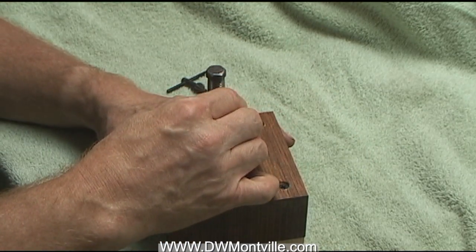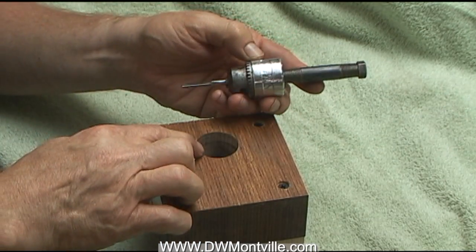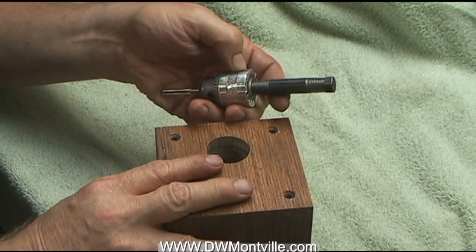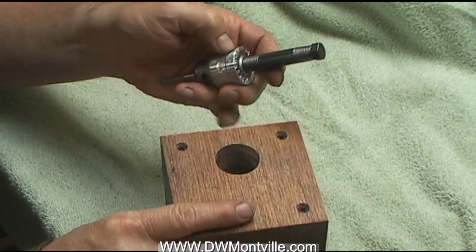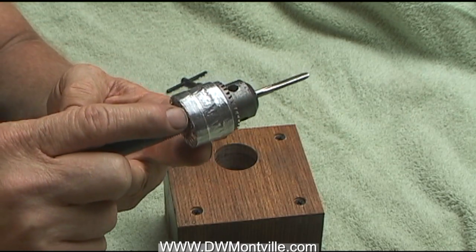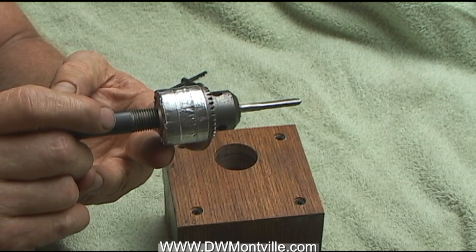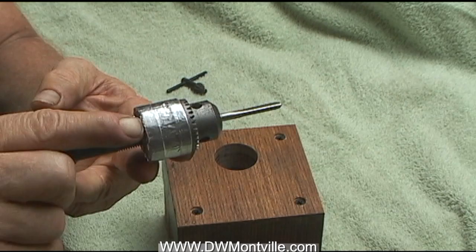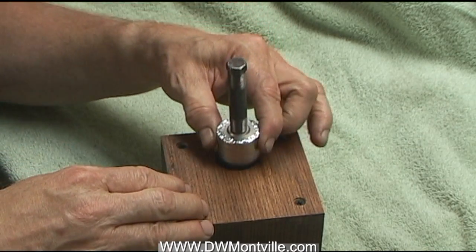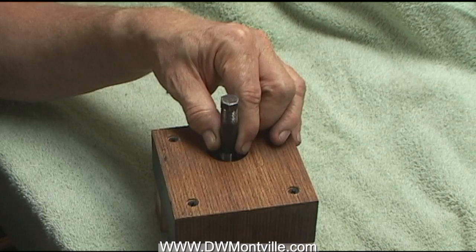This worked really well — it holds the tap perfectly perpendicular at all times and it rotates very easily. I took up some of the slop because this hole was drilled with a Forstner bit and they only come in a limited range of sizes, so I got one that was close but a little bit big. I used some aluminum tape — the kind that's actually aluminum foil on the roll, used for ductwork, available at most home improvement stores — as a self-adhesive shim stock so that the chuck runs true in the hole with very limited runout.